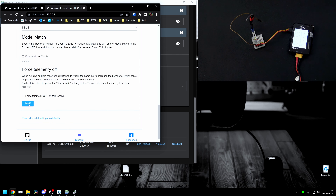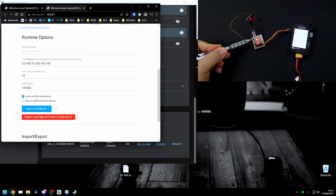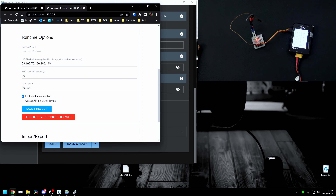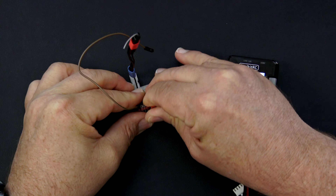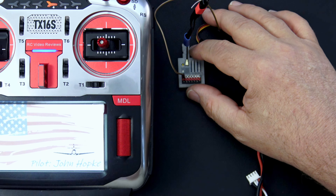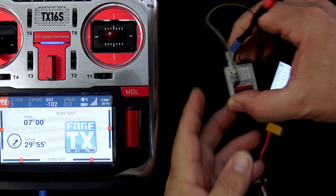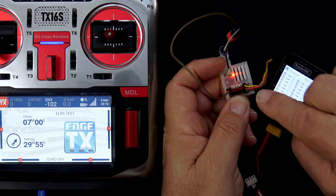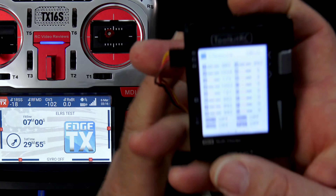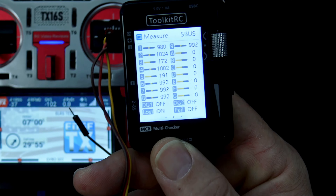Go down and hit save, then go to the main page under options and hit save and reboot. What you're looking for on the receiver is for it to start flashing again — it'll go into AP mode but those changes are now saved. Disconnect power, then turn the radio on first, as you should always do at the field. Make sure you get through any warnings. The next thing to do is plug your SBUS lead into channel 2. If you have a monitor or anything that can visualize SBUS out, bring that up and you should see movement on SBUS.